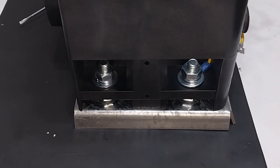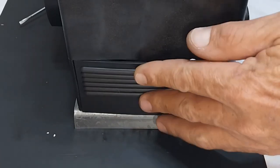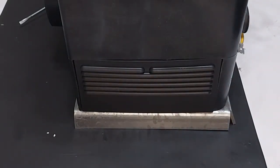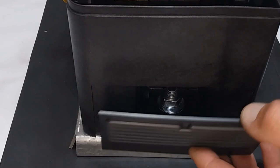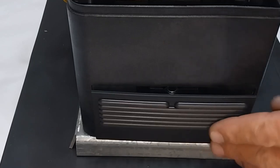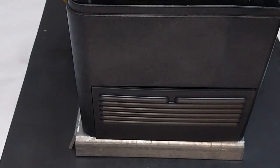With the gate motor properly secured down, welded into place, and all bolts tightened, one can then put the cover plates onto the gate motor base, which hides the steel bolts. It also prevents lizards and mice from entering the gate motor through these vents. The holes are different on each side, so the cover plate cannot be mistakenly placed on the wrong side.